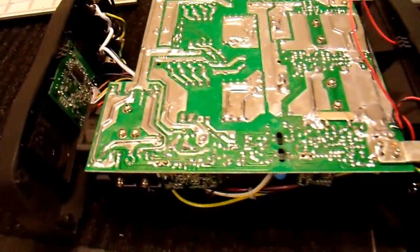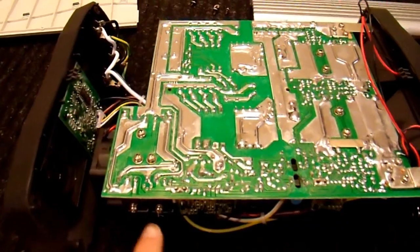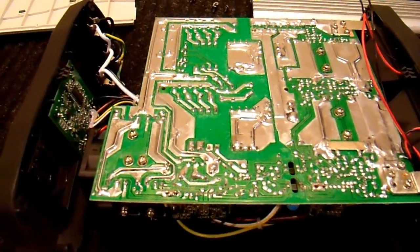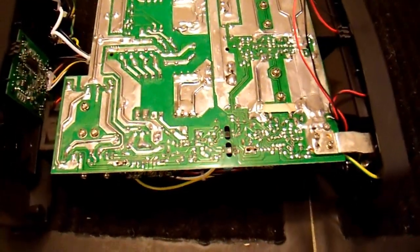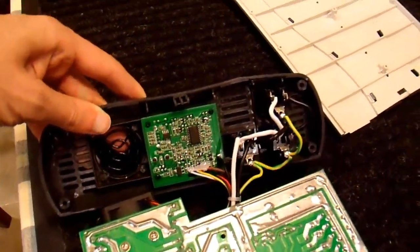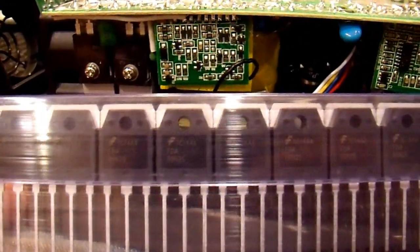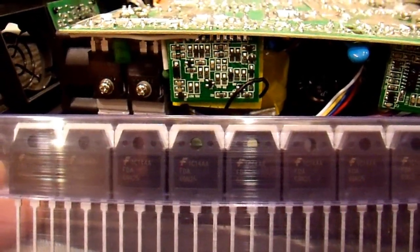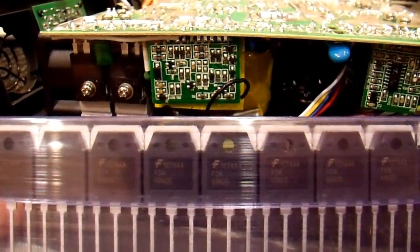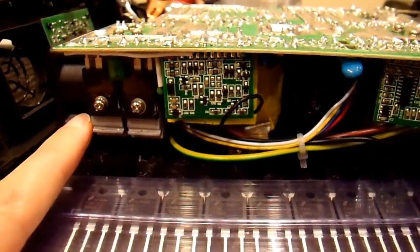At least half of the inverters I get have these output transistors blown up, because they used inadequate transistors rated at 200 volts — they should use 250 volts minimum. So that's what I'm going to replace them with, and this inverter will be better than new by the time I'm done. Assuming there isn't additional damage — sometimes the drive circuitry also gets damaged and then I have to replace that, which can get somewhat involved. In any case, I just wanted to show you this disassembled one. This is my package of replacement transistors: Fairchild FDA 69N25, for anybody who's interested.